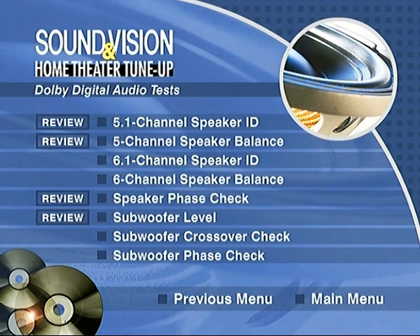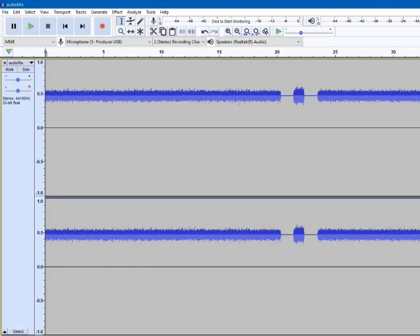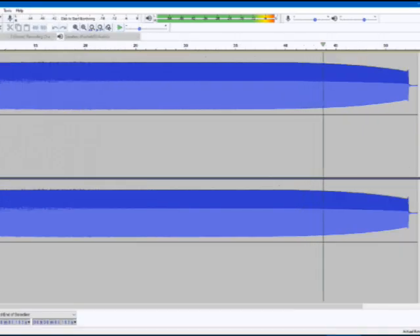I can verify the channels are being mixed together using a speaker phase test — when one channel is out of phase, the audio should cancel itself out. I found another problem: both the left and right channels have a significant DC offset. This limits dynamic range and can cause pops when editing this audio with other sources. From the NAB CD frequency sweep, the waveform suffers from the same DC offset and at higher frequencies it tapers off, meaning it has high frequency loss.